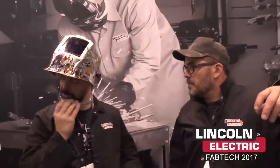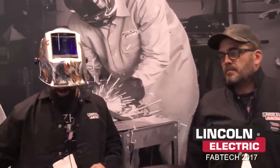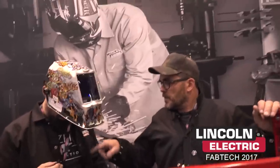If you find yourself chasing holes in your work, it's usually a good indicator that you should step down on wire size. That's funny, chasing holes. One of the best things. Is this thing still okay? I'm having bad luck with microphones today. Okay, there it is.